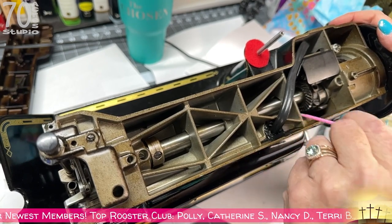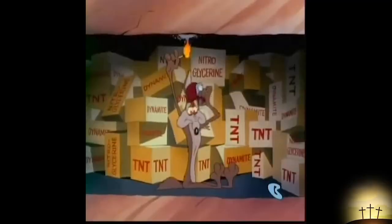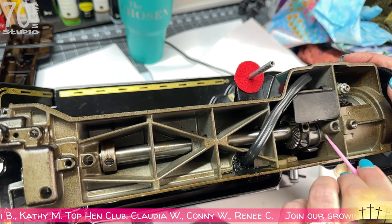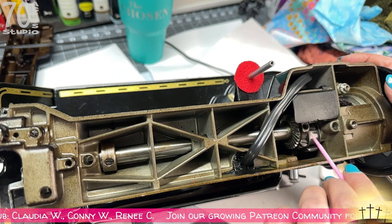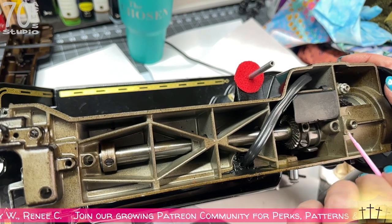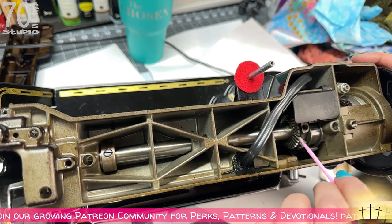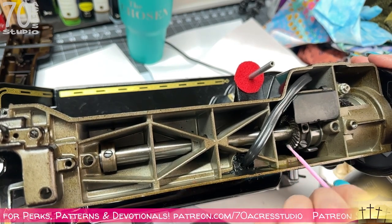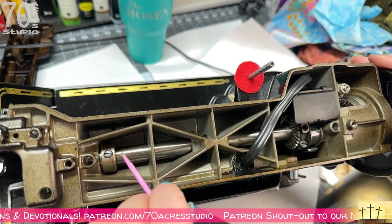And you can see that there's a gear down here deeper too. No, you really can't. It's dark in there. The gears always get grease, not oil. The cams and where metal comes together get oil. I would put some oil right here. This is an oil-wick hole. This is an oil hole because through the bottom of that hole there is one of these cam drive shafts. And I would put some oil in here. And you can just put oil here to keep it working nicely, and some oil over here.